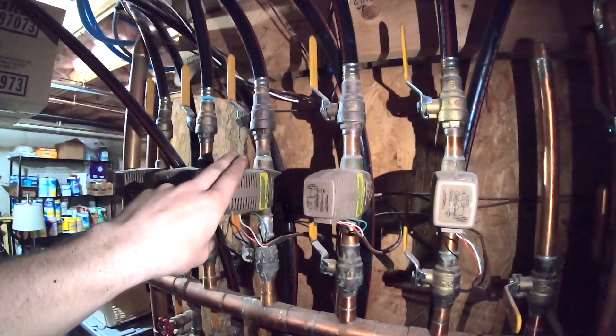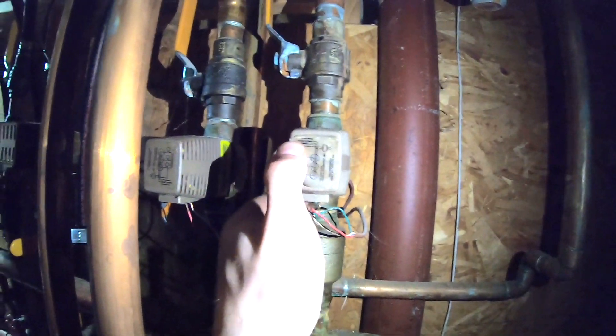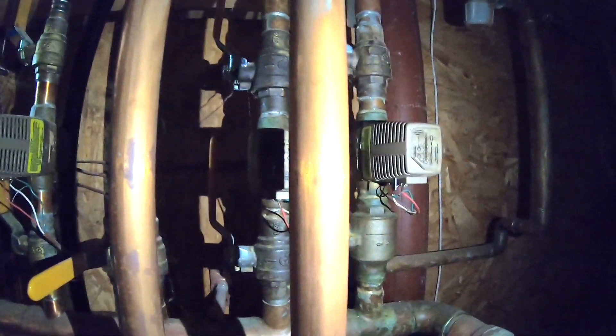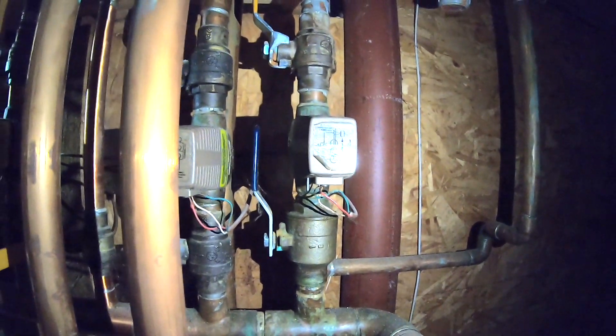These are our heating zones: master bedroom, TV room, in-law apartment, upstairs bedrooms, great room, an extra zone, our water tank, and our floor radiant grid. We leave the floor grid on so it constantly circulates. Now that the heating season is over, we're putting the others back on automatic — controlled by the thermostat — and shutting the thermostats off. We leave the water tank on, but the rest of the heating zones won't call for heat unless we need them. The only circuit we leave open is the radiant floor grid and the heat on the other side of this room.